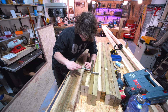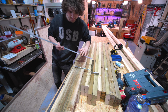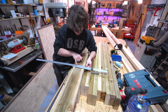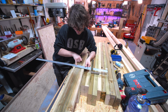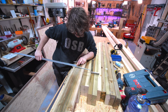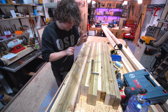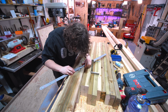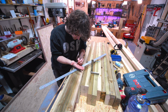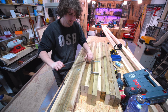That's the inside of the double beam. That's where that's going to be bolted onto the front, which means that right there will be the depth of the counter bore, which is 38 millimeters deep. Just double check that. 38. Yeah, a 38 millimeter counter bore is what we need, which is going to be that diameter, which is something. 38 by 30. 38 deep, 30. D for deep and D for diameter. That doesn't say much. Deep diameter. Done. Cool.